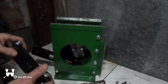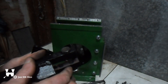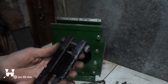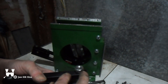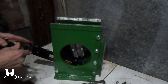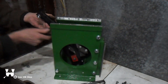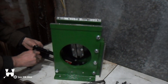I've made the connection bar. It's two pieces of 16 millimeters square stock. I put an angle iron, welded it, so it takes the same position. Drilled two holes, 25 millimeters apart. This part comes here, and the other part will go to the ram.